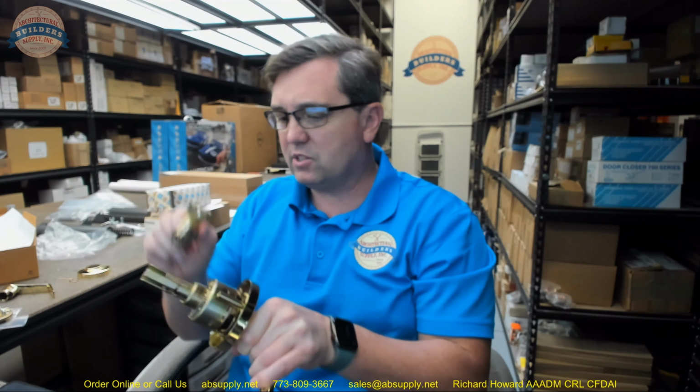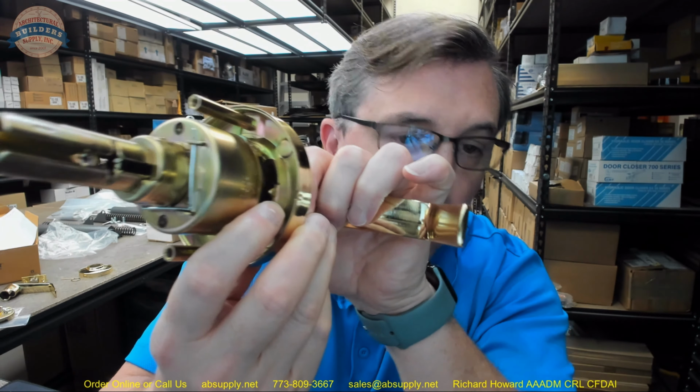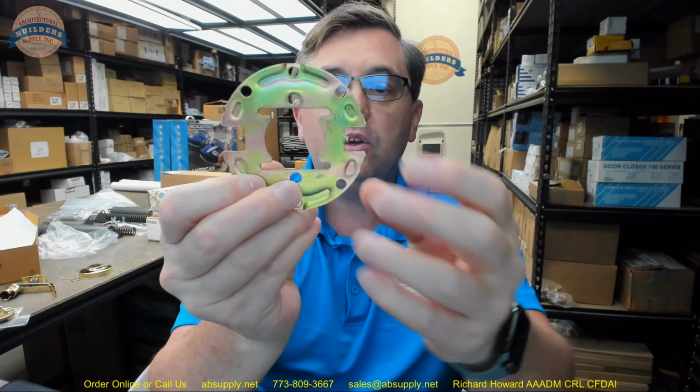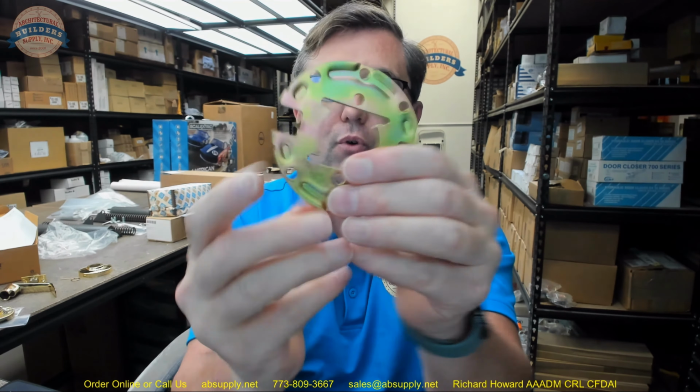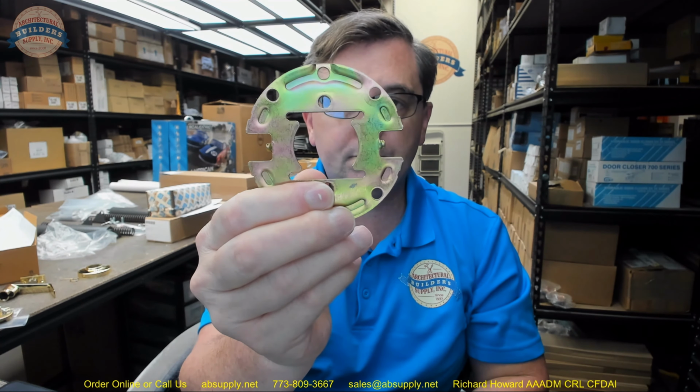You know, they really make locks to be very simple to put together, some more so than others. This is fairly simple. Step 8 is really the important part. The lock's going to go through the door, then you're going to bring your mounting plate. Now, one thing I didn't mention on the template: at the 3 o'clock and 9 o'clock positions, there is a notch. That's to accommodate in the steel door the prong that's here, and the prong that's on the mounting plate. You know that the mounting plate is installed this way because these prongs will be at 9 and 3 o'clock. That's important to know.